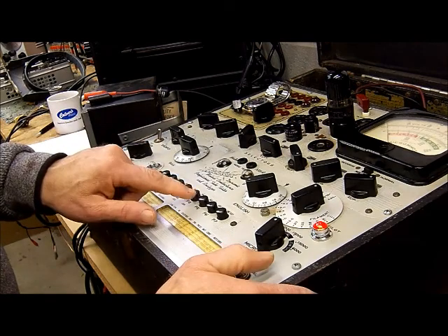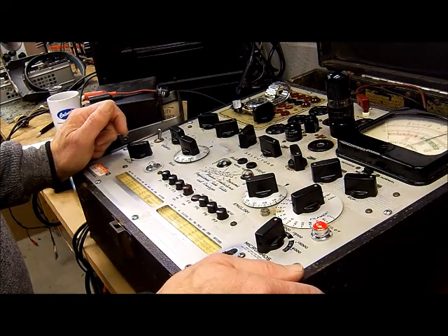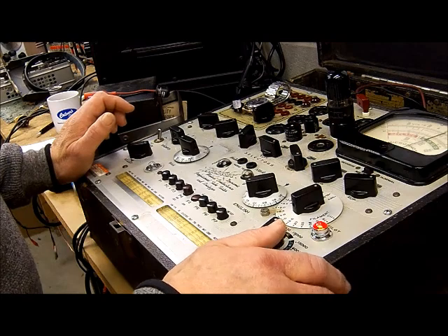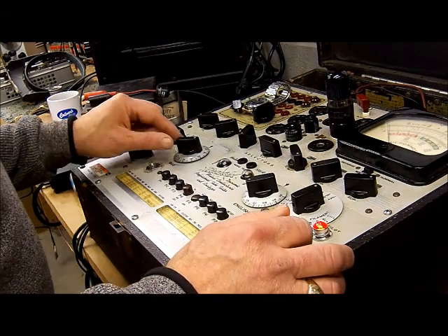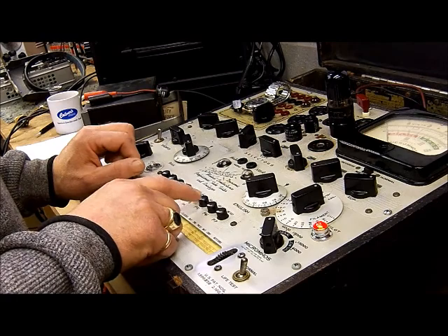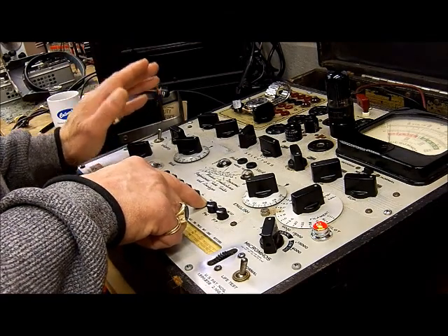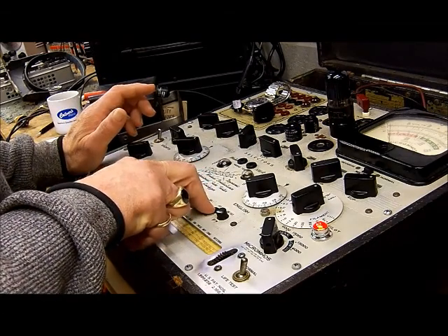I'm going to do a life test on it. I have a lockdown button that I will depress — it's sitting right next to the momentary button. On life test I do reduce the voltage slightly. The needle drops slightly, but not enough to cause any concern. So this is a good tube. There is one final test I will do, which is gas. I need to set my scale at 3000, turn the bias control pretty far up so I don't peg the meter. I'll push down P5, which is gas 1, and bring my bias pot into range where I'm reading about 100 micromhos. I don't want it to go above 100 or 200. If it goes up one division, that's okay, but any more and we have to throw out the tube. I'll depress P6 — there is no movement. This is a very good tube.